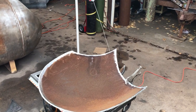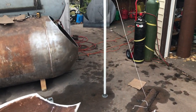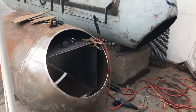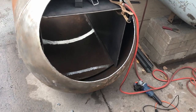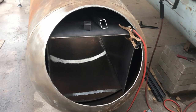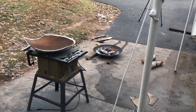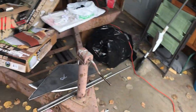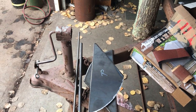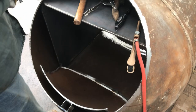This piece is ground and ready. The end is beveled. So what we're going to do is try to get it in. First we're going to put that little piece of the 2x2 right up front here, put it down there to get it spaced correctly. And then you can see the grind marks that piece will be welded into. And then over here, those are the side two pieces that will be going in there. There's the tacks.